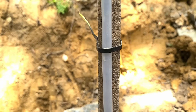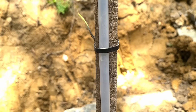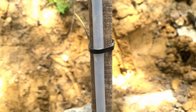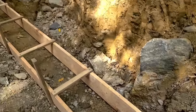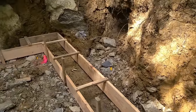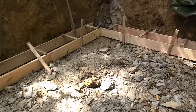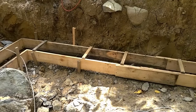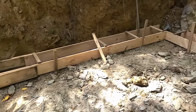And if that line of water in there is hidden by the zip tie, I'm calling it perfectly level with a slight variance, give or take a 16th of an inch. So I've checked it all the way around, especially the board that's inside our direction here. And then we level horizontally to the outside board with the cross ties, like so.